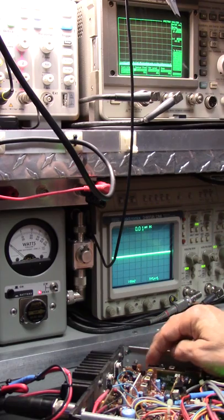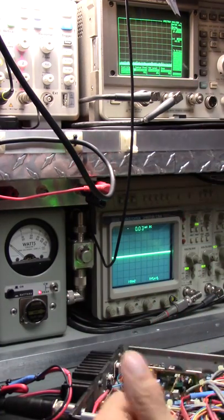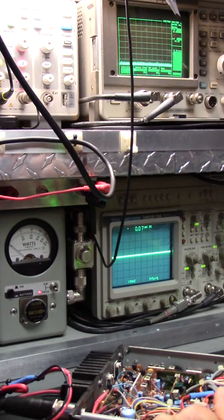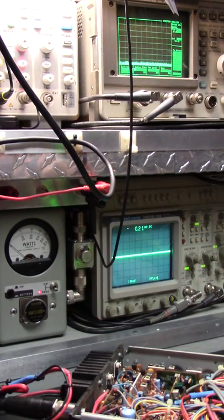A high level is done differently. The carrier is generated when you key the mic. Say, for instance, you got a 10-pill, an 8-pill sitting there, and you got a Class C, or just a typical 29 or something else. This is where the meter-banging watts you always see, they'll never show you everything all at the same time because they can't seem to figure this out. They might be able to say it with their lips, but they can't do it. It's where when you start pinching, clipping, IMD all over the place, but the meter goes blowing all kinds of watts all over the place. You hear that certain guy's radios way out there in the distance, barefoot out talking to you.